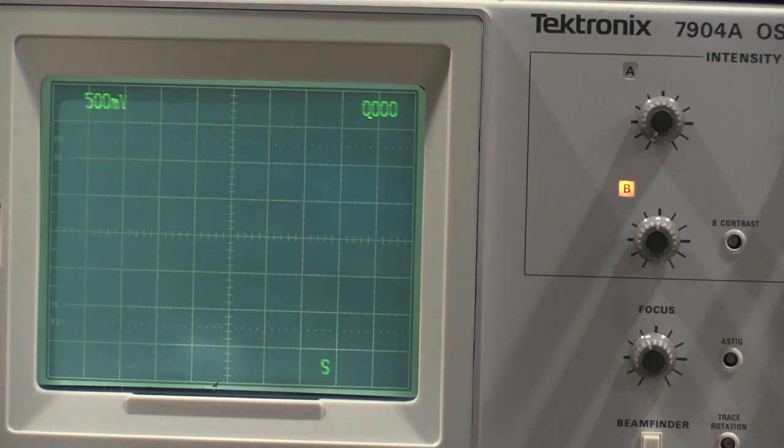But if we have power supplies and we have main reference, the next thing I'm going to check is actually the reset, so how the unit resets the count. Because if the reset's not going correctly, it's going to do stupid stuff. So the three things that I need to check right now before we do anything else, because we've cleaned it and the fault still stays, so there is going to be something to fix on this: power supplies, main clock, and reset. If I have those, then we're going to be into ICs, doing a few other things, seeing where the faults lead us to get it resolved.